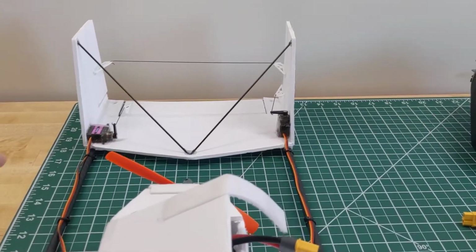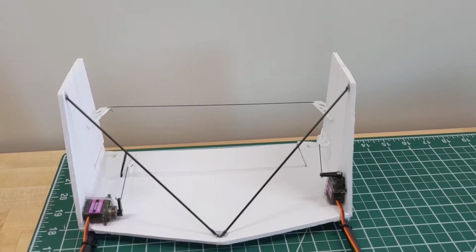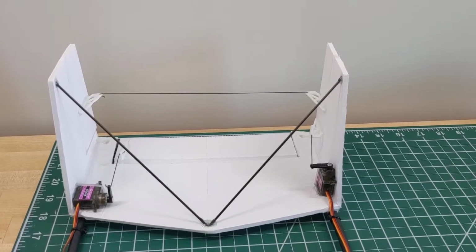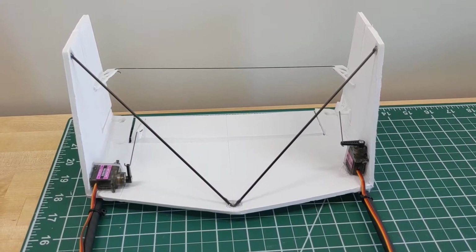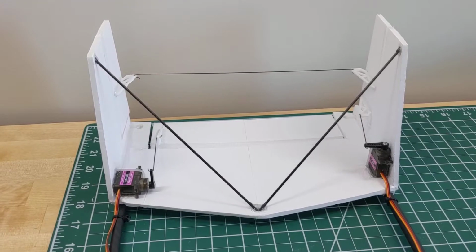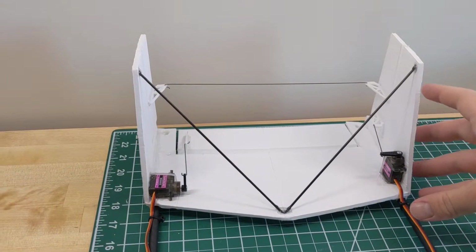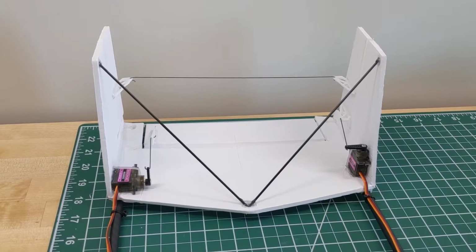I figured it would be much easier to get a solid mechanical link if the servos were in the back, near the tail, so they have much shorter control arms. And so far that seems to work. It is a little bit tail heavy, so even if I get it to balance, the mass out on the tail is going to contribute to a higher moment of inertia.